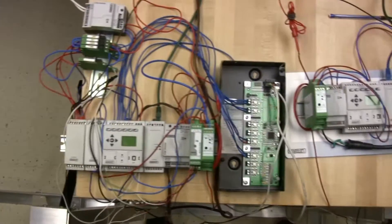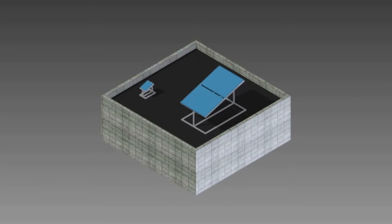We use a variety of Phoenix Contact equipment to do control and sensor measurements. We move the panels using motors donated from Lutron and linear actuators. For the elevation axis of the array, we use the nano solar calculator to track the sun's seasonal changes. For the polar axis, we used a small solar panel to scan the sky and track the sun throughout the day. When the scanning panel finds the best angle, the large array is sent to that same angle. This is beneficial for when the best angle might be slightly different than the expected orthogonal value.